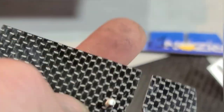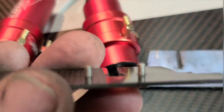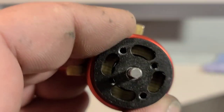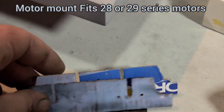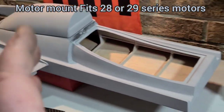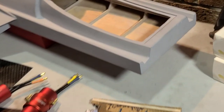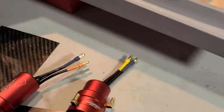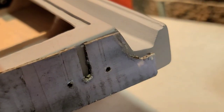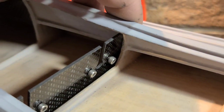On these screws, when you're screwing them into your motor, make sure they're not too long. My screws were a little long so I had to take them to the grinder and grind them down because they were actually touching that dust protector. You want to make sure they don't run into that, your stator, your coils, your winds. For the motor mount, I had two designs in mind — running the motors close together or farther apart. I went with the wider style mount because we're going to have counter-rotating props that spin outward, which might give a little more stability. It's a top-loaded design that basically snaps in under this little bulkhead runner, and the mount is going to stiffen up and add structure to the hull because I'm going to epoxy all the way around.